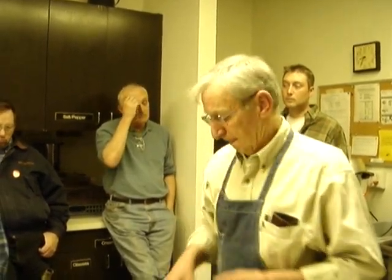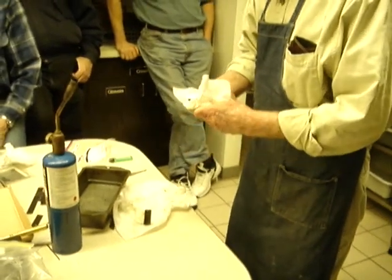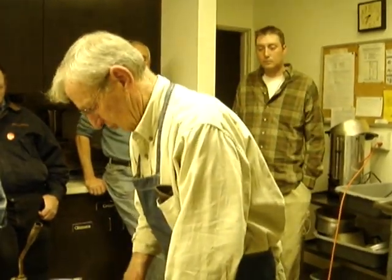So you've got water, and then you have oil, and then you have air quenching. Air quenching, you just bring it up to temperature and leave it to cool. You can buy steel just for air, air hardening steel. It's got something in the alloy that really cools down fast. You just bring it up to temperature and leave it to cool. That's all. There is no liquid bath quench.